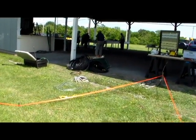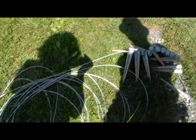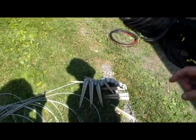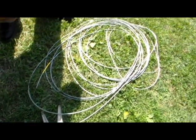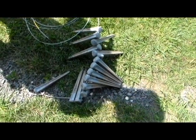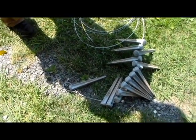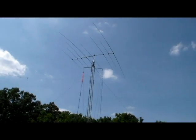That other set of wires laying on the ground there is a surface wire grounding array — a final-issue item from the Natick Soldier Center in Massachusetts. They went down to Florida with a team from MIT and Caltech and did extensive testing, finding it works better than the nine-foot-driven rod that used to be issued for grounding mobile equipment. They use this to circle the entire piece of equipment, drive these less-than-one-foot rods at intervals along the wire, and it also comes with jumper wires to ground that circle back to the vehicle at the corners so that when you're done it's completely encircled.